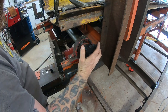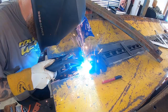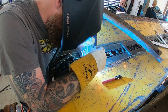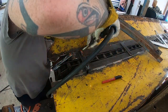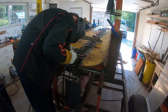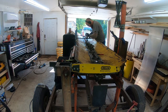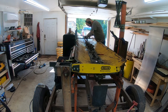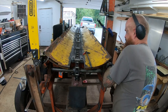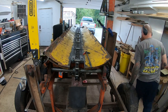That's the drive sprocket — I don't remember the tooth count, but this is from Red Bore as well. They were one of the few places I could find that had a drive sprocket for an inch-and-three-quarter shaft. I had to weld 40 of these teeth on. One thing I did find while rolling this chain around is the welds were a little too thick for my clearances on the 2x2 square tubing, so I ground some of the welds down to make clearance.